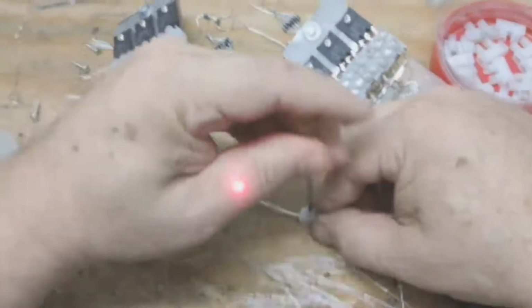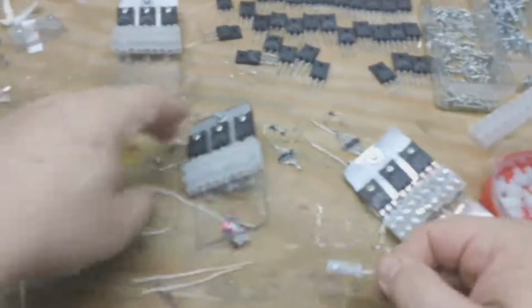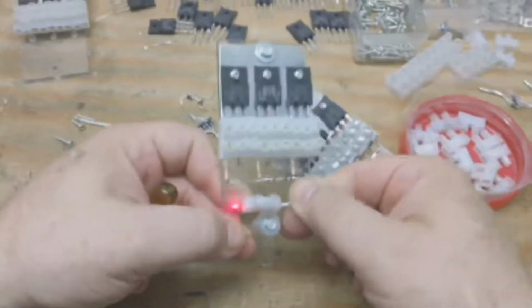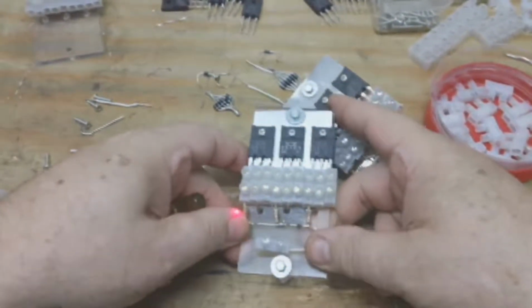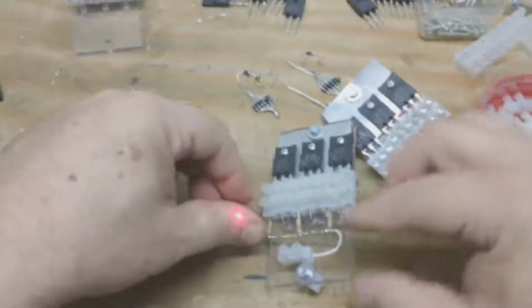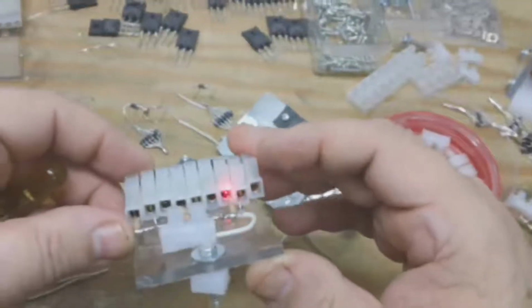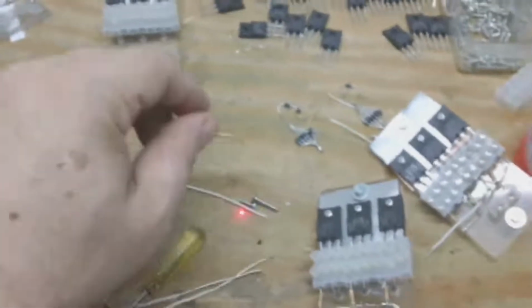Now this is the other end, where the trigger is connected, so the trigger wire from the coil is connected to this resistor pack. So take that, loop that back around like that, and then we're going to stick it right in there like that right there. Now I don't want to tighten it up yet because I still got to put the diode loop in there. If you made it properly, it would probably just stay in there anyway. You want to make sure you get all your wires underneath those connectors, because it's real easy to miss, and then that chip is not going to work. You're going to actually lose power by not ensuring that's in there properly.